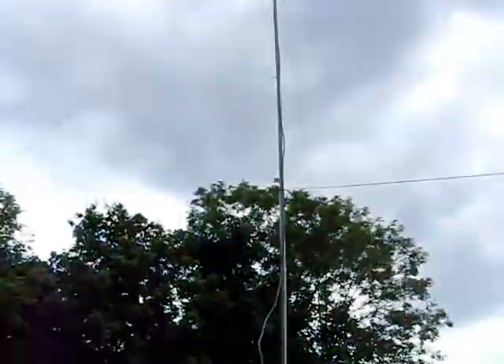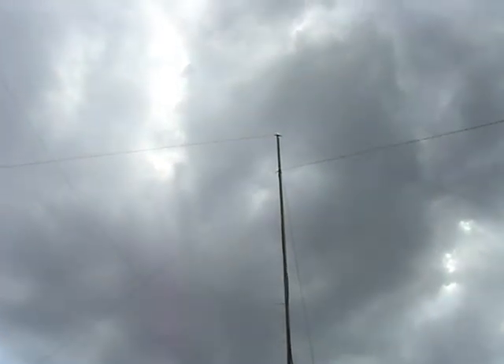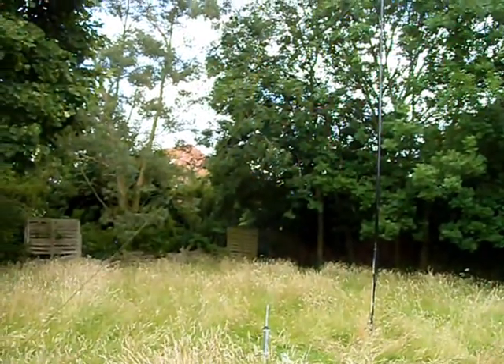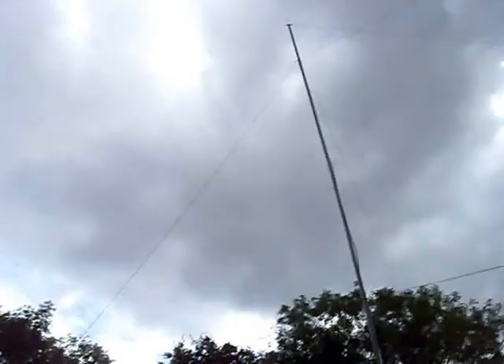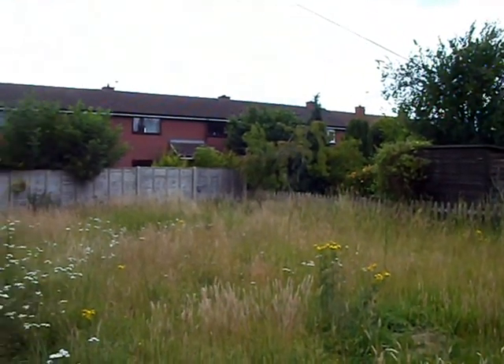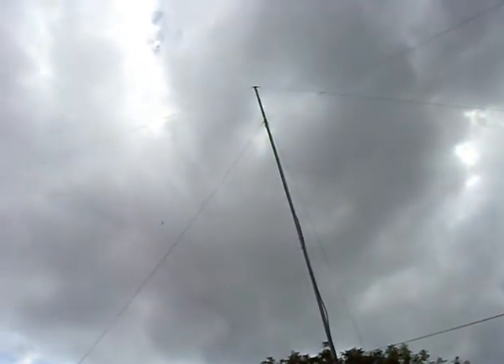I put the big pole up, so I think we're peaking out at maybe 12 metres at the top. And that has got a half-wave 80 metre dipole. One end terminates at the bottom of that tree, and the other goes over and terminates in the corner over there on that tree. You can see quite a lot of guy ropes and stuff needed to keep it up in the air.